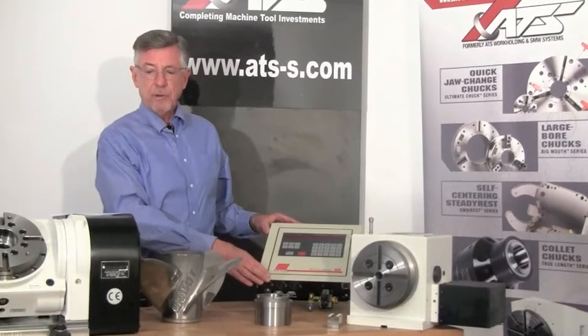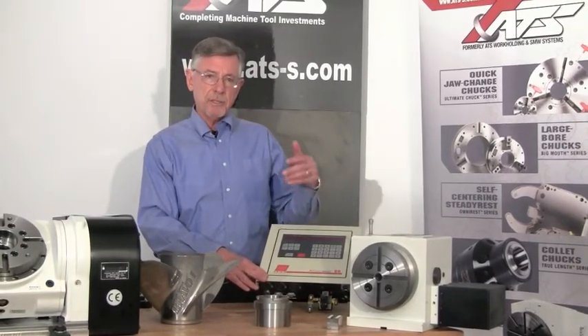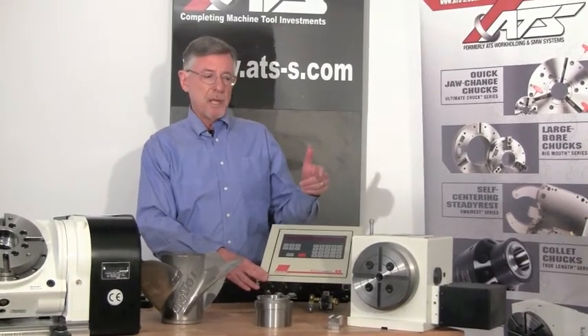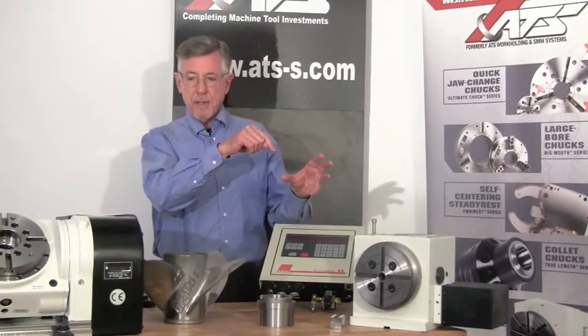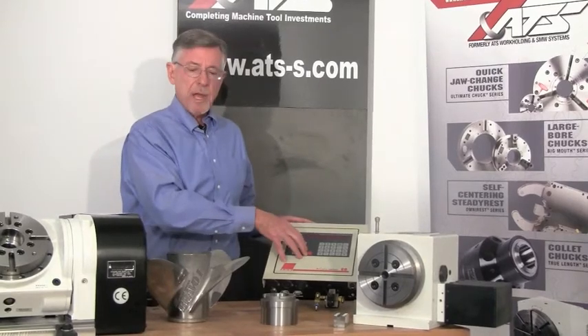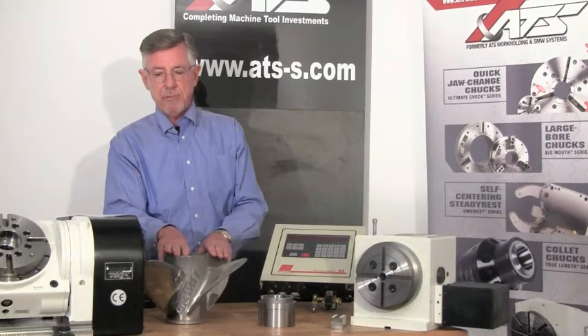This is our AccuSmart control. It will drive a rotary table to any of 360,000 positions around a circle, and it will drive you for doing slow feed rate rotary cutting. The only thing you can't properly do with the AccuSmart is make simultaneous rotary and XYZ moves.